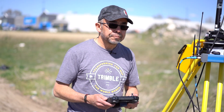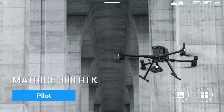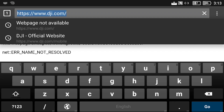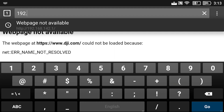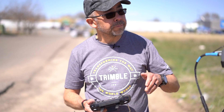Once I connect to it, I can then launch the browser — the Lightning Fast browser that's on this device — by clicking the back key, hitting the applications menu, and clicking on Lightning Browser. Once in Lightning Browser, I just need to type in the IP address that's supported by all Trimble receivers. That IP address is 192.168.142.1, and that's for any Trimble receiver that supports web UI. I hit go and I am connecting to the web UI from this controller to that receiver.